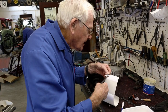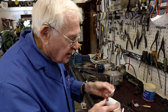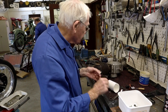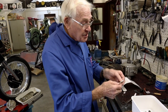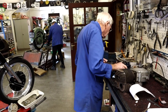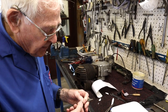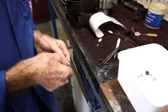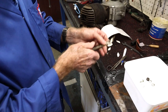This is the easy way to do it. I always remember when I worked at Ariels in the development shop - in the early days you'd have to meticulously mark and scribe the steel from big blueprint plans. The quickest way was just to cut the bit out of the drawing, stick it on the metal and cut it out, and you knew it was perfect. So I just get a bit of metal, stick the template on like that, and then you've got the shape you need.